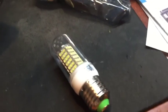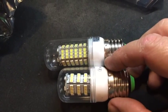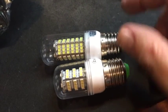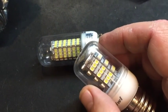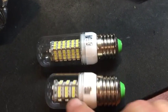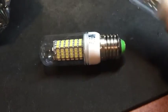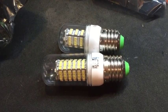Now I'm wondering, because I got to put 5 bulbs in each, then I might end up going with these. These are 5 watt compared to 9 watt. The difference is that with 5 bulbs, I only got to worry about 25 watts compared to 45 watts with 5 of these 9 watt bulbs. So I think I'm gonna work with the 5 watt, because I don't think my battery will be able to sustain a charge long enough to maintain the 9 watt bulbs for at least 4 or 5 hours. That's what I want. I want it to stay on at least till after midnight, and then maybe go off around 2 or 3 in the morning. See how that works.